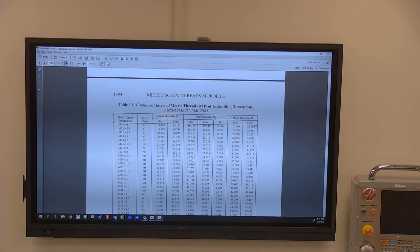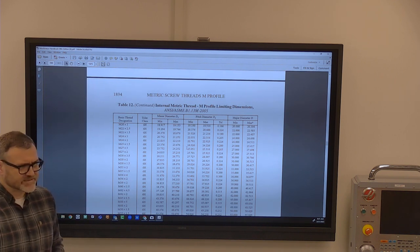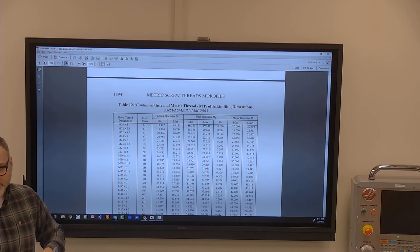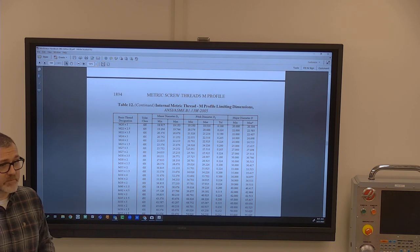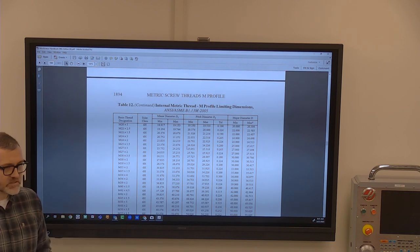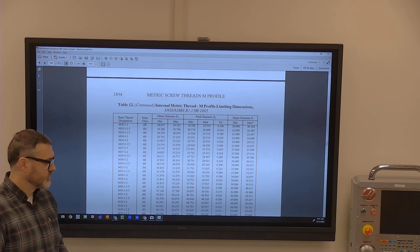So same thing though, you're going to just watch it as it moves up, 0 to 1. I really like those better. The thing I don't like about these is sometimes people will get these things jammed in, not in all the way, and they'll measure something. They're like, dude, it's like 127 thousandths off. And you'll go up to the rod and push it in all the way, and they're like, oh, okay. So typically saves their part though.